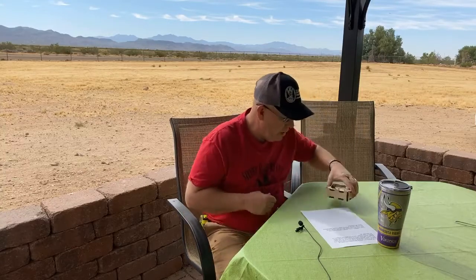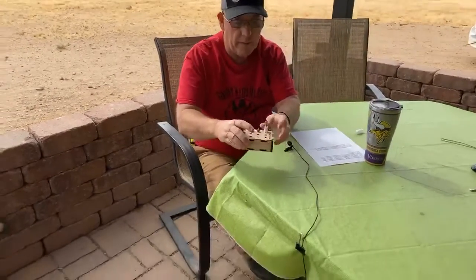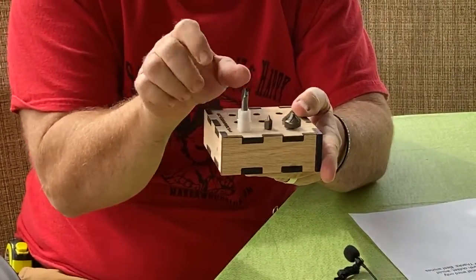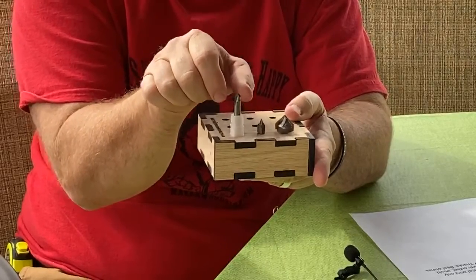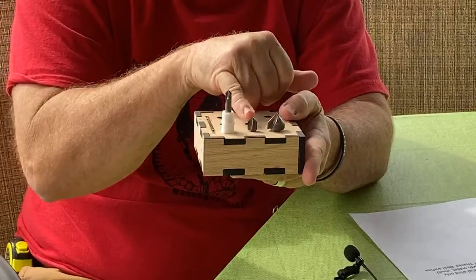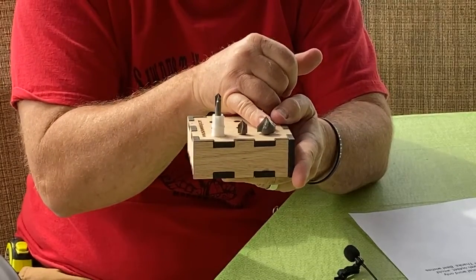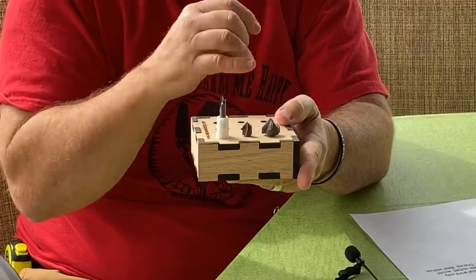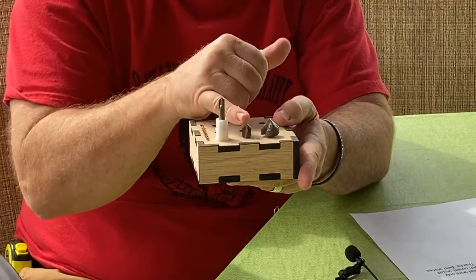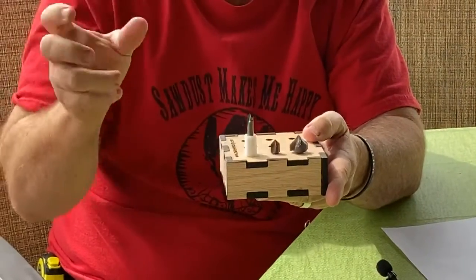So let me show you the difference between three different 90-degree bits. This is the one that we use currently, which is 90-degree, with a quarter-inch shank, and only a quarter-inch cutting flute. This one is a 3/8, it's 90-degree, but this is a 3/8 cutting flute. This is a 90-degree, but it's a 3/4-inch cutting flute. So you could see that, even though it's a 90-degree, the same degree as these, it will fit in smaller spaces without going really wide.